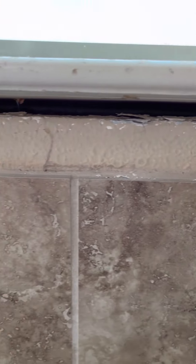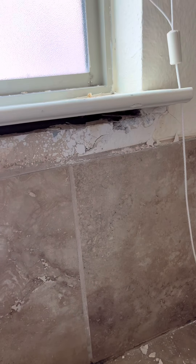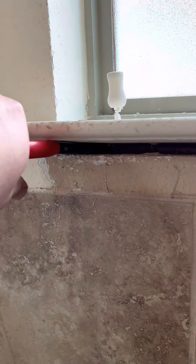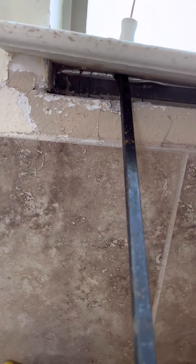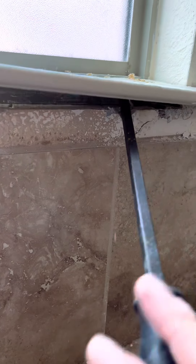Now I can get to my nails. Since this one's in there so good, I'm going to trim those nails off and get rid of all of those, then come back — should be able to just pull this out. Getting in here is actually kind of a pain. I'm going to take my diagonal cutters and get in here and just trim whatever I can get to. It still doesn't want to come off, so sometimes you have to get in here with a different blade. Now I'm able to ride that drywall, which is going to be covered anyway, and just use gentle steady pressure and pry this bad boy up and out to minimize the damage.